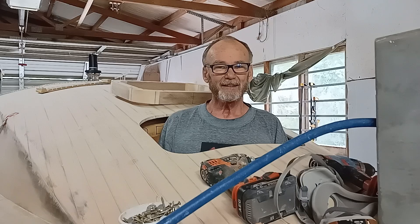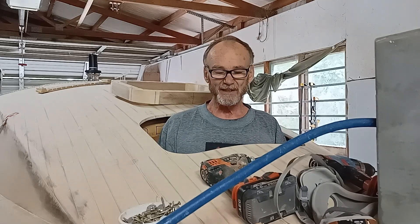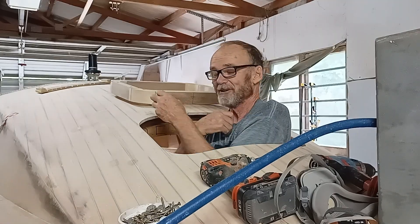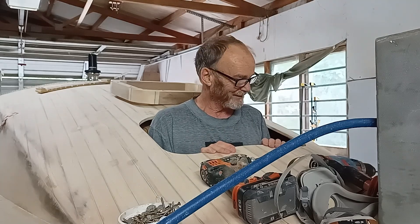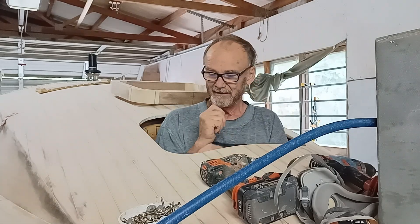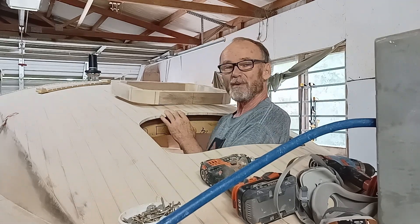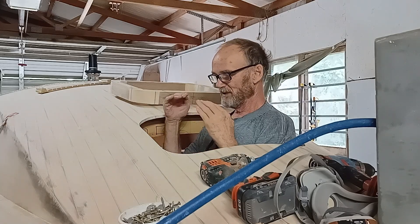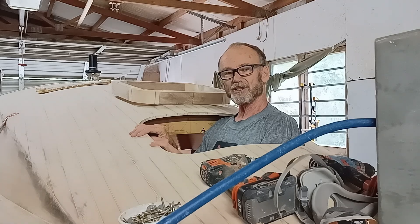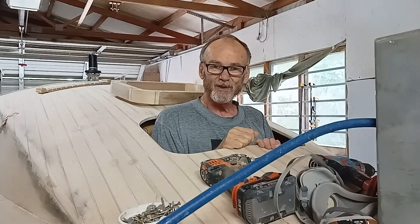It's a really humid day — it's been raining, so I expected this. But I can't fit this hatch around with it so out of whack, so I'm going to have to put screws back in on this side and this side. Some of that will be because the timber wants to straighten a bit now that I've cut the hole out and it's not under so much tension. Anyway, time to redrill some holes.